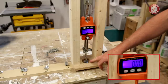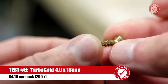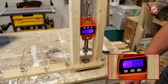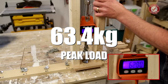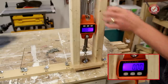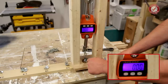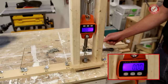Number six — we're back to Turbo Gold screws, but these are 4mm by 16mm, so a bit of a wider thread. We're still at a safe 16mm length with no risk of going through the 18mm MDF. These are £4.19 for 200. Let's go for it... oh, that didn't do very well. How bizarre. This is confirming what I was saying about the more aggressive thread — the rifled shank and self-drilling tip may be eating too much of the MDF away. Didn't do too good that one.